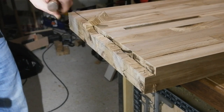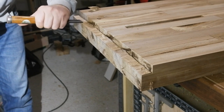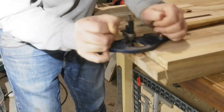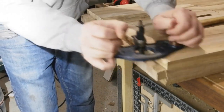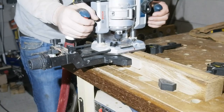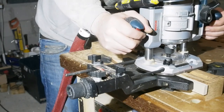There are many ways you could remove the waste to create the tenon — multiple passes on the table saw or plunge saw as I did earlier, or use a router etc. I opted to simply chisel it away, a pretty quick process when you're in the groove, especially with the grain orientated as it is. Then a cleanup and final size with the router plane, then on to mortising the end pieces. I'm aiming for a snug but not tight fit — I want some allowance for any movement.